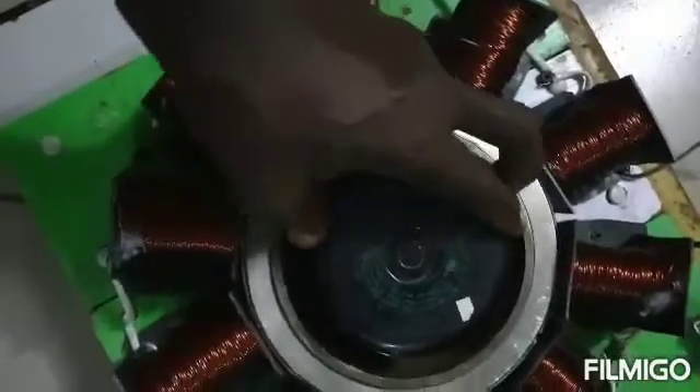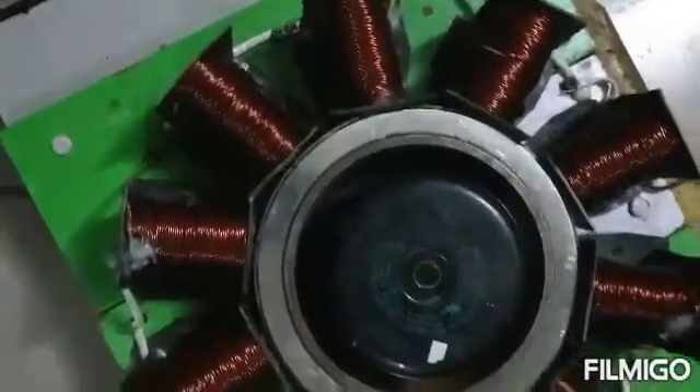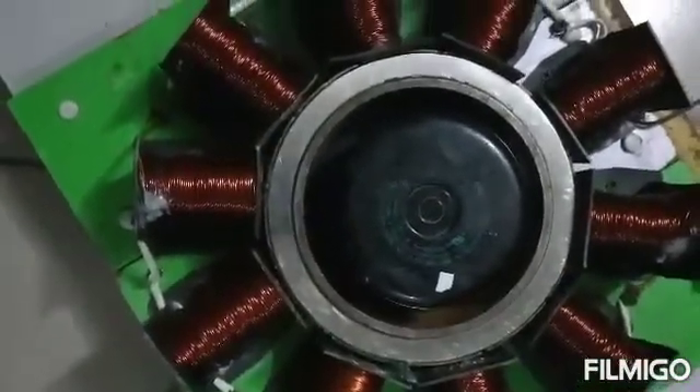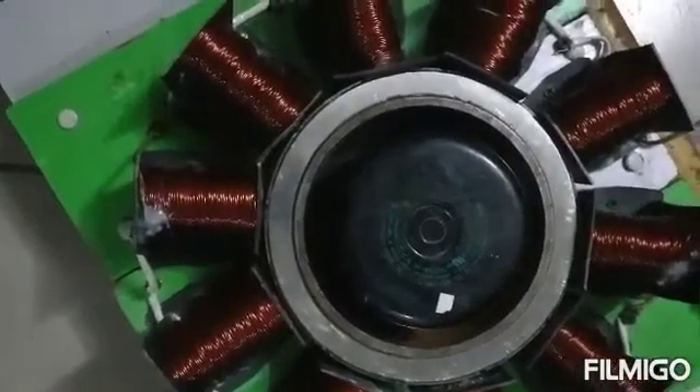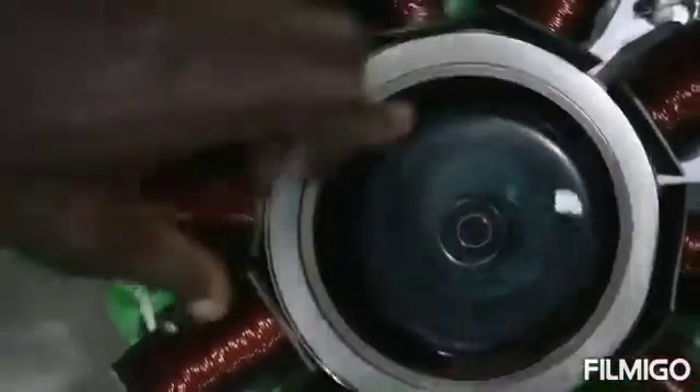This driving motor is a BLDC motor. It runs from 24 volts to 57 volts. So I am going to supply it with 48 volts at 3 amps, which is less than 150 watts. This BLDC motor is rated for 208 watts at 1,930 RPM. We are supposed to run it from 36 to 57 volts, so I am going to run it at 48 volts, which will give me more than 2,000 RPM.